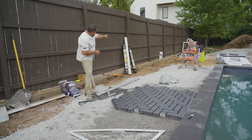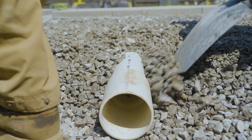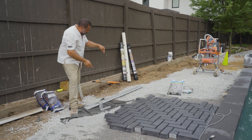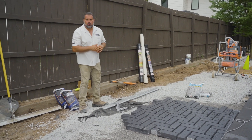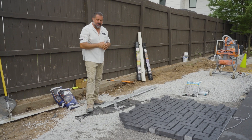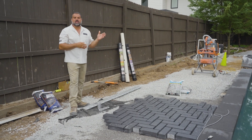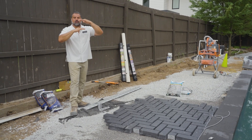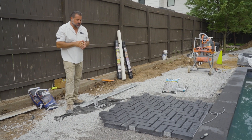On top of that, we have an exfiltration pipe — a PVC pipe with holes down, four inches, completely encapsulated with four inches of clean stone. Water will bypass in a major rain event and infiltrate into the soil. If it were to back up, it will get into that pipe and into a dry well right in this planting area. On top of that, we'll put another four inches of clean stone with very little compactive effort needed. Because of the particle range in our base and bedding layer, we chose a GF4.4 nonwoven geotextile to separate them, resisting migration of our bedding layer into the base, used in all vehicular and pedestrian traffic applications.